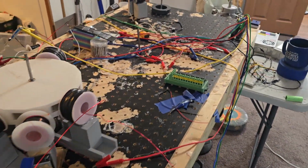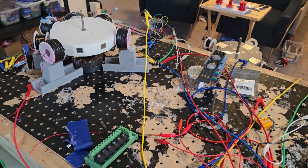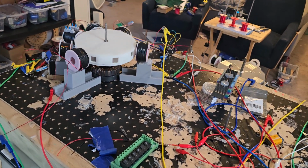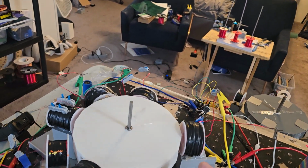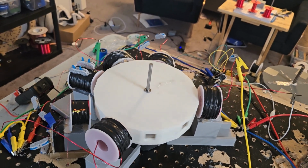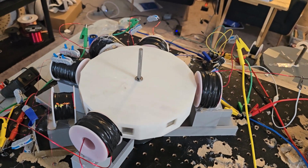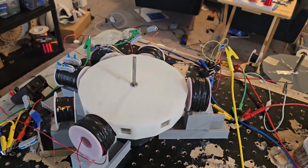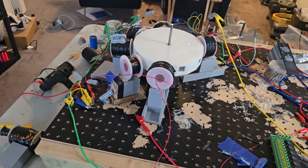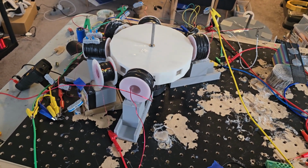So the timing's good. Just need to get the positioning right, and it should fly. I'm going to put 3.5 volts in. Get it going just a little faster. It should take right off. It doesn't accelerate as fast as a series circuit does, and it takes more power than a series circuit does. Well, it takes power differently. Less voltage, more amps.